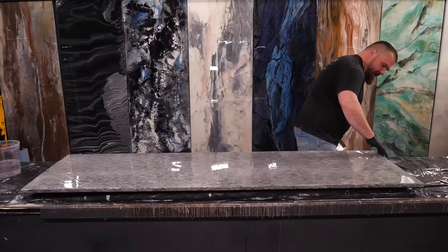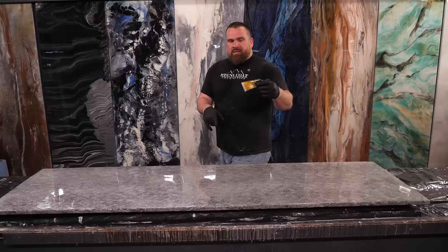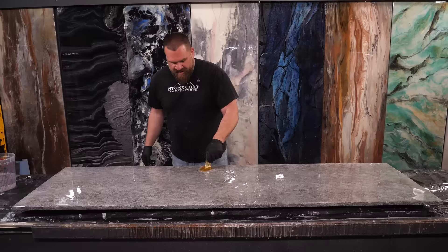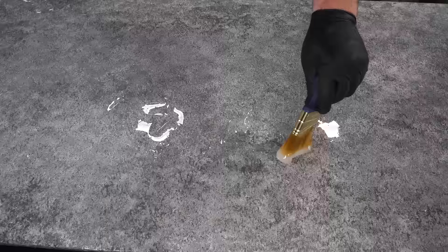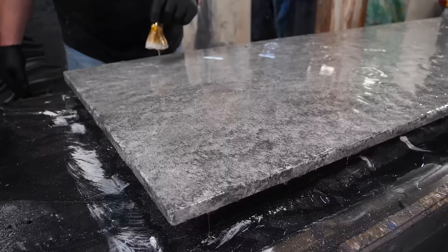The project's almost done — it's time to chop the top. We're using a two-inch angled nylon brush. To chop the top, we use the heel of the brush and randomly cover the whole surface. This eliminates trowel lines and mixes the material one final time, ensuring a very good cure. There's no real wrong way to do this — don't use the tip, that's the wrong way. Using the heel, it's spreading out and covering more area. This project is pretty much done — I am loving the black specs addition.